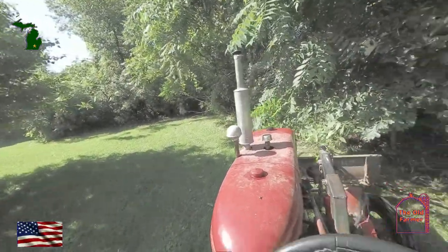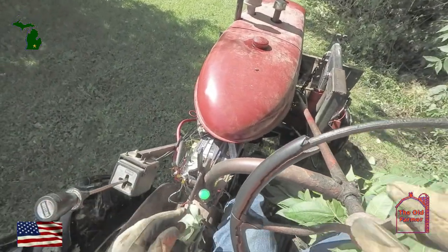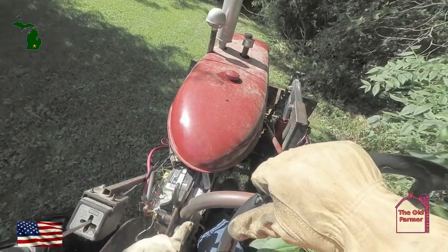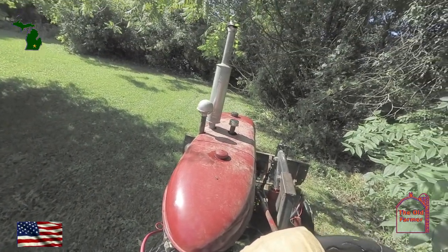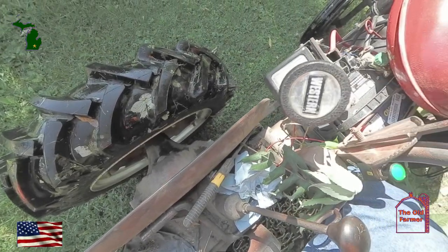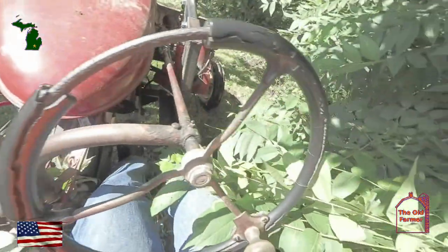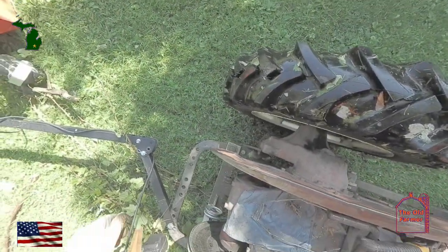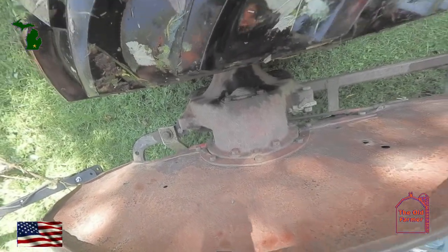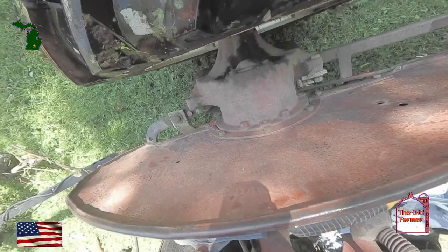I then tried mowing a strip of the neighbor's high grass. I had adjusted the deck from the highest setting to about 2.5 inches, and after 2 passes, all I did was knock off the top 1/3 of the grass. When I tried mowing the grass along the road that was mowed several times a year, it did a much better job. Most pros will not sharpen the blades, only replace them if they get out of balance. But the Baldwin PTO-driven brush mower does a better job on tall grass. This is what I think.